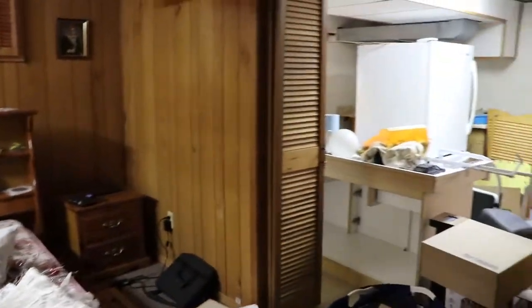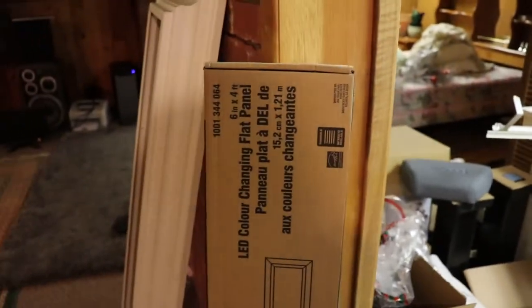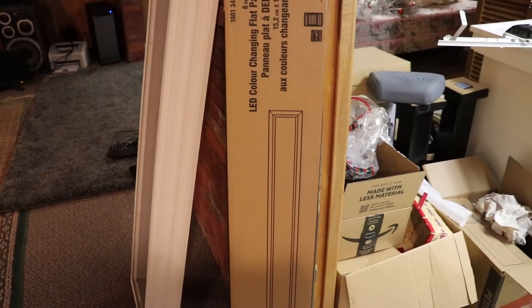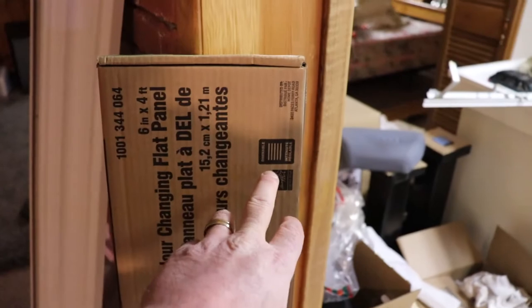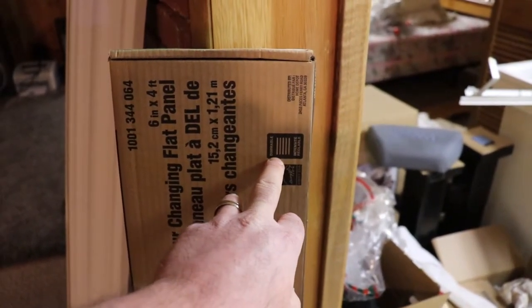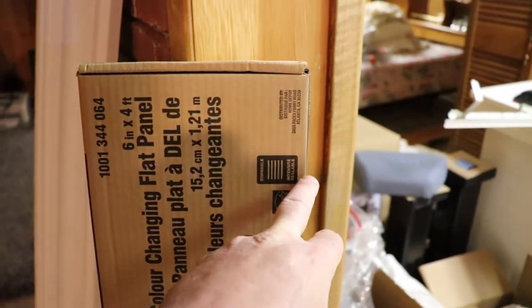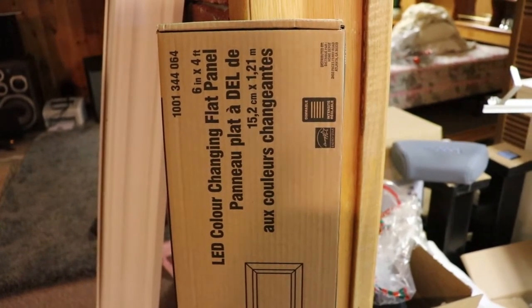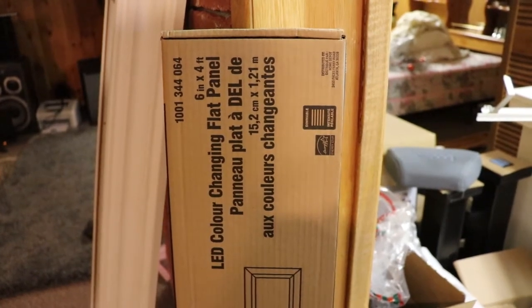Where are we going to go from here? Right, so they do make a dimmable fluorescent LED fixture replacement. So you'll see these upstairs in a couple of different locations. You can buy these from Commercial Electric, and they're dimmable. These are the more expensive brand version of the dimmable. They make another version that says 0 to 10 volts, but you don't want those. Those are for commercial settings with occupancy sensors, and you don't want that. So just go with these.